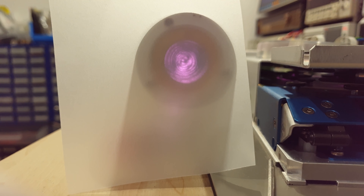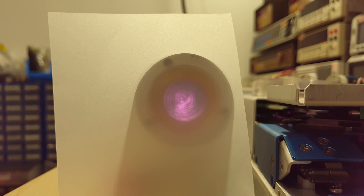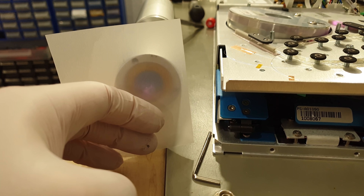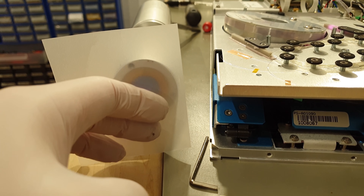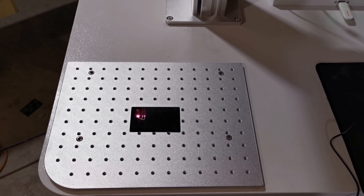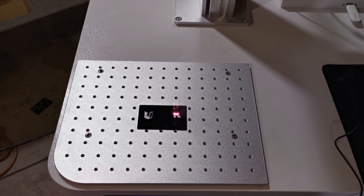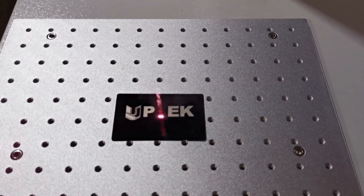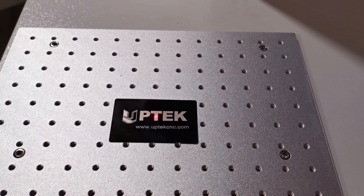Well, that looks a lot better, but not perfect yet. Maybe we've finally discovered the reason why this thing is on my table and not in its natural industrial habitat. I can feel warmth from the expanded beam. I have neither mirror galvanometer nor f-theta lens at the moment, and I want to investigate that blind spot before going full power. But this is kind of how it'll look in a few weeks — maybe we can trim some metal film resistors in circuit without heating them.